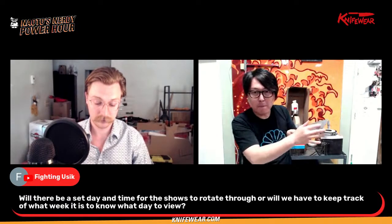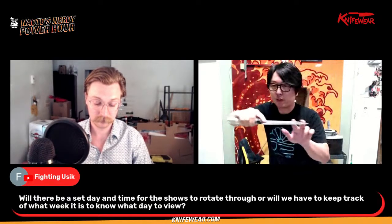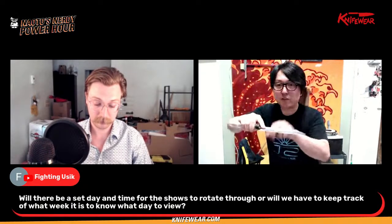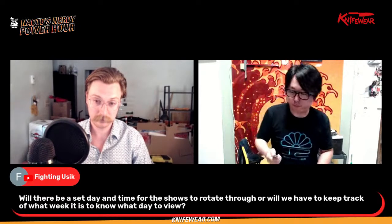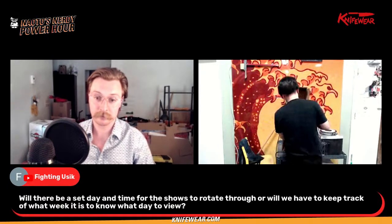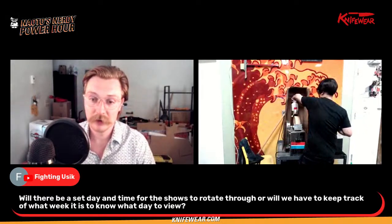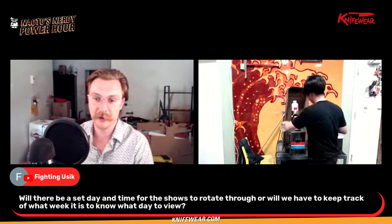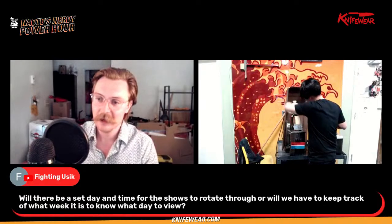It's not clean yet. Then I'm going to put it on the vertical like this. Horizontal, diagonal like this. Then I start to sharpen the bevel. Make sense? Kind of? Makes sense. Yeah, well, because if you just laid it flat, you get that concave bevel back. So that makes sense. That was going to be my question, but I'm glad you got to it.